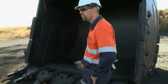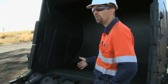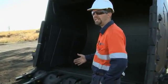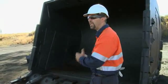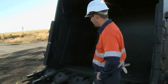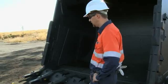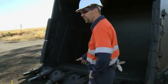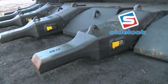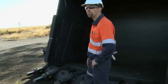What we'll do is we'll run through, we'll pull the tooth off, show you a few little things to do when you pull the tooth off to help you speed things up a little bit and also aid in when you go to fit it back up to make it a lot easier. And some of the other little points like the dirt plugs that really need to be replaced, just to help with the material wash over the top and help it chisel sharpen.